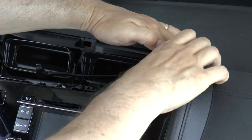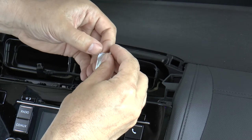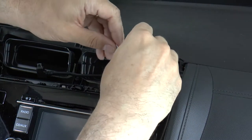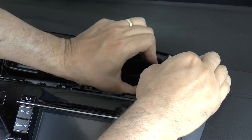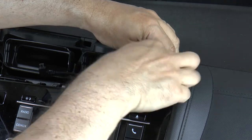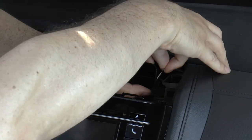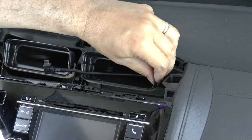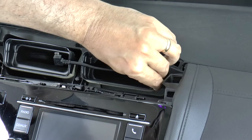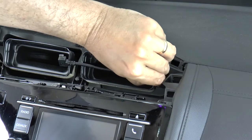I've cut off a piece of tape and I'm going to work it around here, then trim it down to the right size. You can cut this really easily with scissors — I'm just using the snips since I've got them. This stuff is actually a thin sheet of aluminum foil with adhesive on one side — it's used for heating and air conditioning work. It does a really nice job of sealing ducts and I like to use it for taping down wires. It forms really nicely around curves and the adhesive is good because it's designed to stay in a building for years, but it's not all that difficult to remove either.